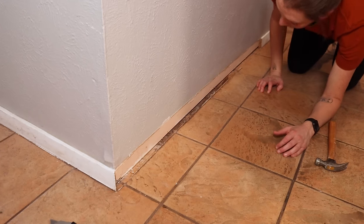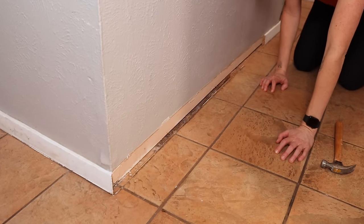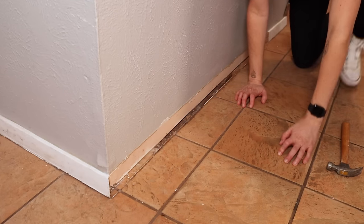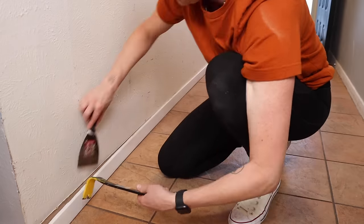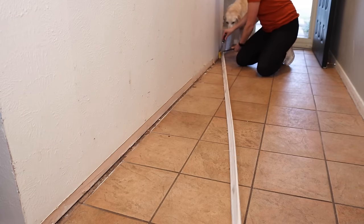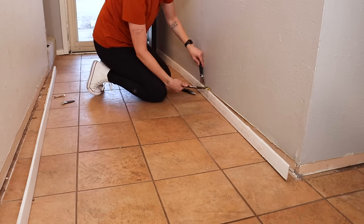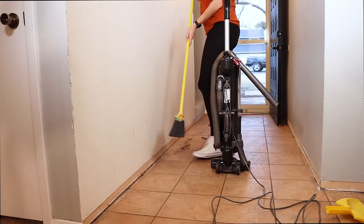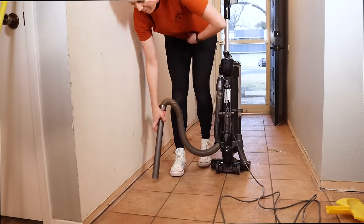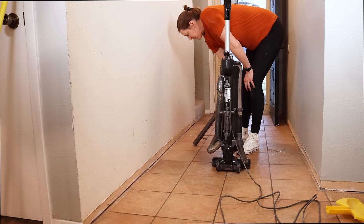This works well at preventing damage to your drywall as you pry the baseboards loose. And this was my first look at how gross it was underneath these old baseboards — it's almost like somebody spilled something. I worked my way around until all the baseboards were removed, being sure to also remove any caulk left on the floor. I'm so glad I made the extra effort for this step. I feel better knowing it's now clean behind those super gross baseboards, and as you'll see in the end, the new ones look so much better.